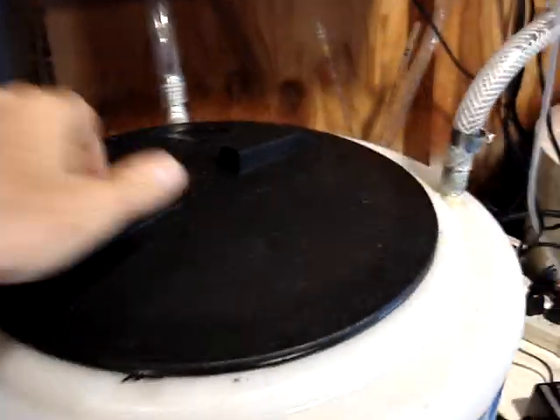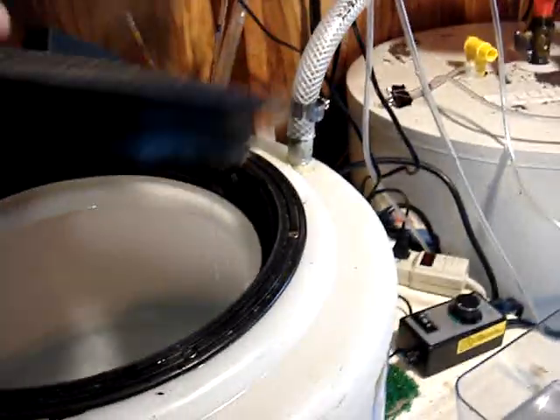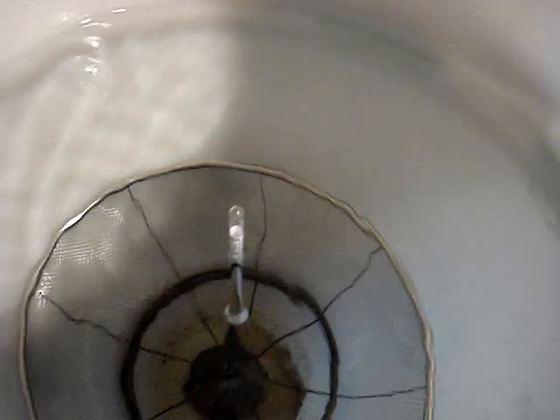It's condensing down into my methoxide tank, which I can also pump methanol into. Right now I've just got recovered methanol in it. You can see it dripping — recovered methanol dripping right now. There's also a hydrometer in there to give me the percent purity. It looks like it's sitting on the bottom a little bit, so it's not giving me a good reading, but when I get up to a few more gallons, you can just read the percent purity right on the hydrometer.